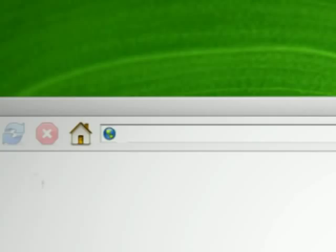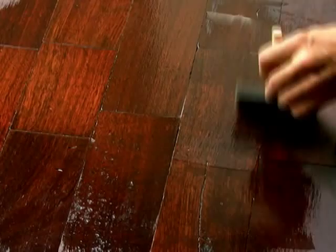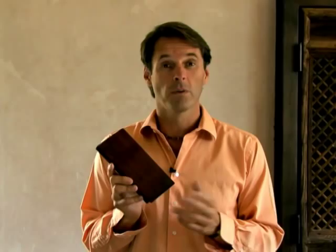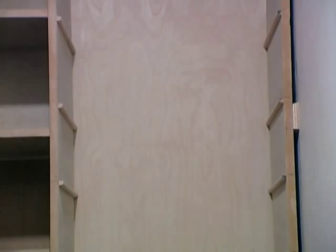For more information, go to our website at buildinggreentv.com. After the floors are stained, a hard wax is applied and then buffed to really bring out the shine. With the floors done and some leftover pieces, we're going to use every last piece by building shoe racks for our closets. The carpenters start by gluing several strips of flooring together to make panels for shelves. Then the panels are sanded, and a box for the shoe shelves is shimmed, glued, and nailed in place. While that is happening, the closet shelves are being installed.